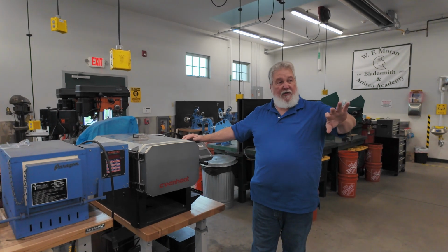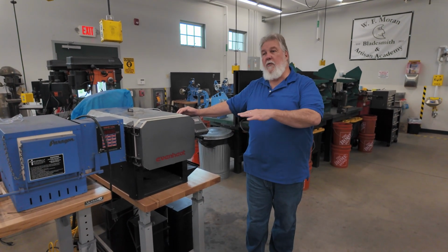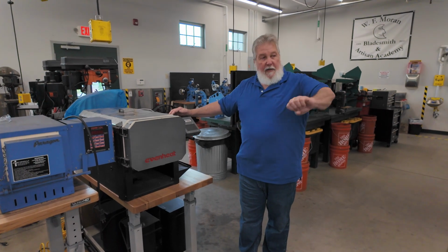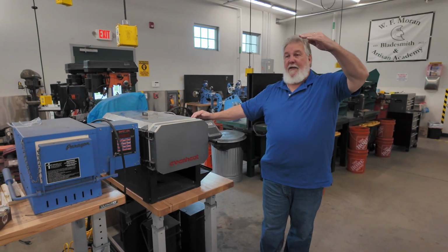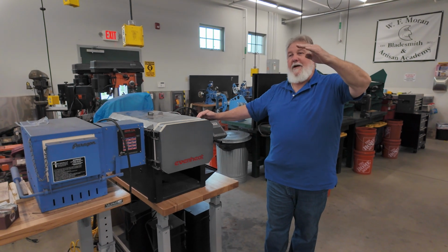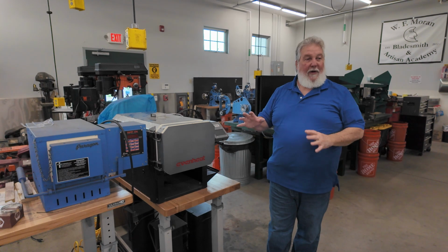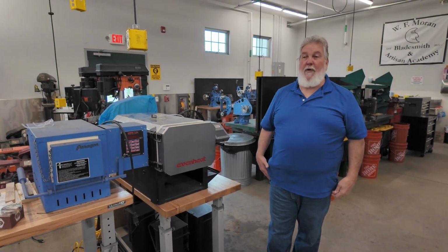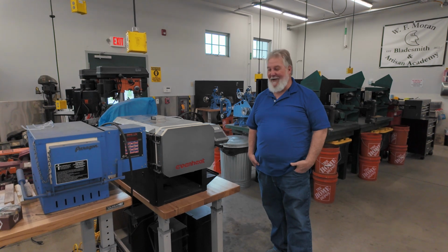So if we're trying to cycle and we don't want the temperature to go below 1800 degrees, it cuts back on at 1800, and if the high limit is 2100, it cuts out and then waits till it gets back down, then cuts back on. So we never have to worry about having a problem as long as the PID controllers are working correctly.